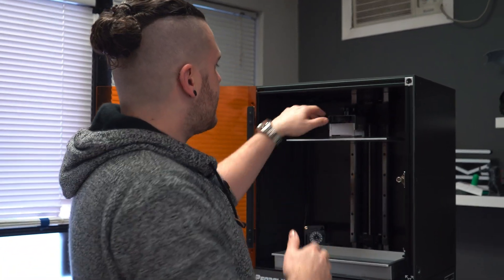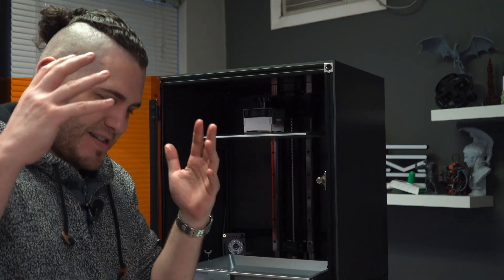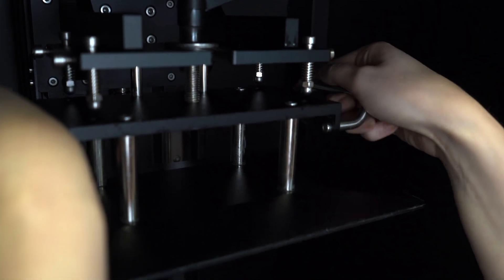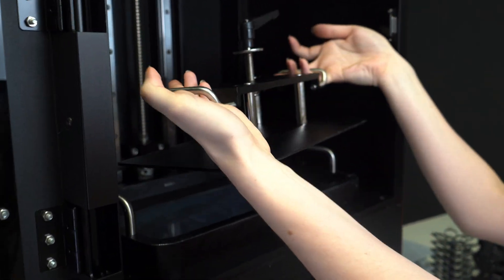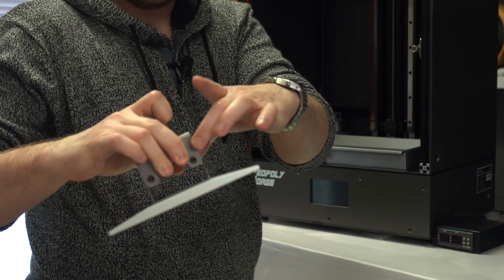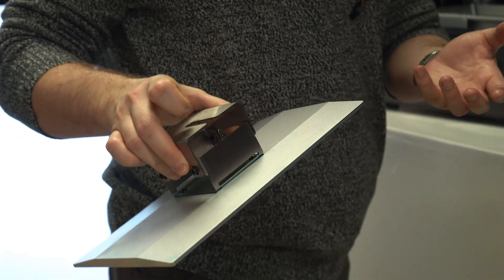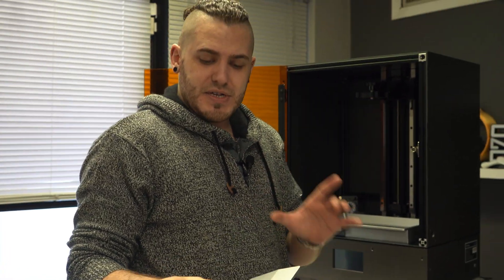Another aspect of build quality I find notable is the build plate itself — it's incredibly simple. The Jupiter build plate had those wonky tower feet things, which I think were designed to keep the build plate clean but extend it further into the resin. They just didn't do that with this. They went with the ultra simple four-point screws, which I believe is a similar trait shared with Phrozen. Very simple, gives you all the access to play with your leveling. It's very solid, simple, cheap, and effective.